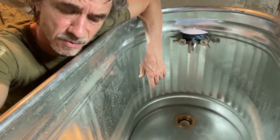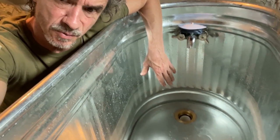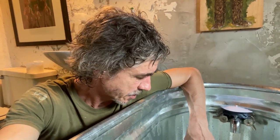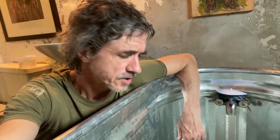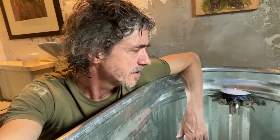The one thing that was also sort of difficult was that the bottom is stainless. If you're going to use the hole saw on that, it doesn't work so good, but you can do it. I cut through it, but stainless is very difficult to cut. That's probably the only difficulty you'll have — dealing with the stainless. The galvanized part cut like butter; I went right through that.